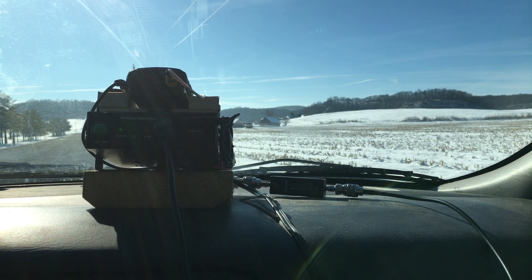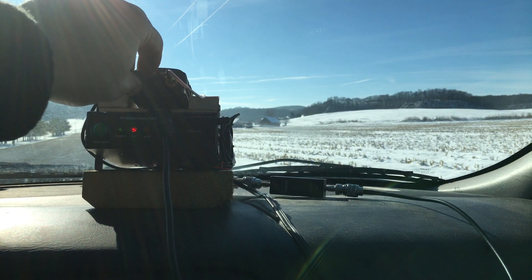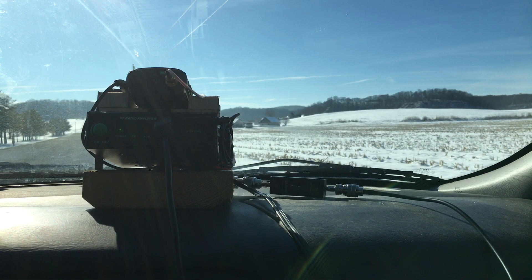We're at another location — 4.112 miles away from the repeater as the crow flies. Radio check 1, 2, 3, 4, 4, 3, 2, 1. We're getting scratchy but I can make it out. We're still at about 1.56 SWR, 27.8 watts output. Multiple radio checks — scratchy but readable. This is really getting pretty good. If you can see in the picture there are bluffs — my repeater is in a horrible location.